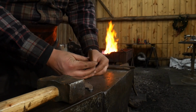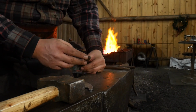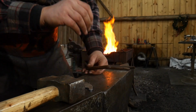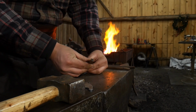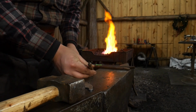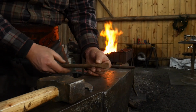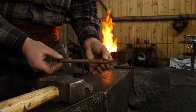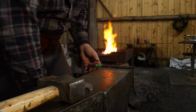This is optional. An eye punch adds a little bit of extra character to the eyeball, but it's not necessary. You can just punch in with some center punches, or with a round punch. A 1/4-inch round punch could be nice just for the eyes themselves, but I like using an eyeball punch, so I'll be using that on this one. A curved chisel can add a lot of extra dimension, but it's not necessary. Again, I have this, so I might use that on this project here.